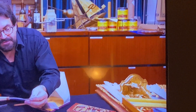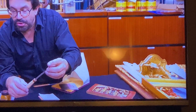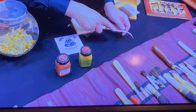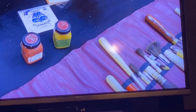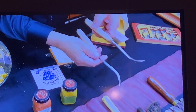We just talked about recutting tools. These are specifically made in France and the world buys them — England, Germany — for recutting. These are carving tools for plaster or gesso. I grip it with the index finger out, as if my finger is part of the tool, and do a flick like this — flicking and cutting. I may outline something like the flower motif we just had, doing flicks and pulls. Different intensity goes lower if you pull it out of the surface of the gesso, giving a lighter line. There are all types of recarving or cutting tools in France — an essential part of the total restoration gilder's repertoire.